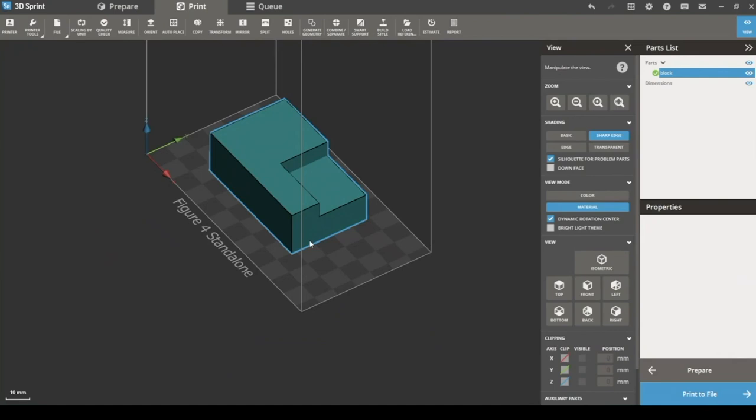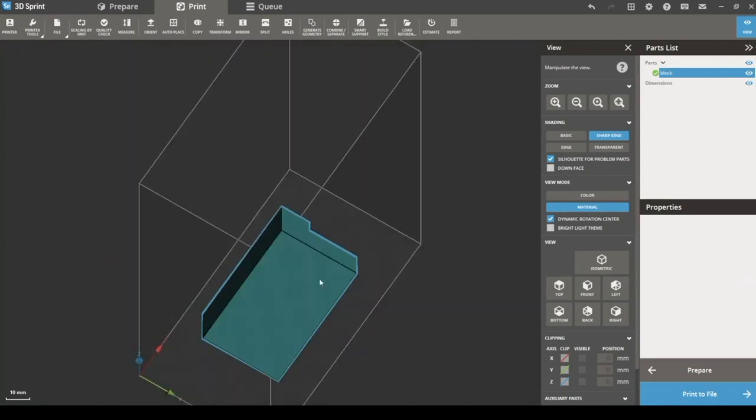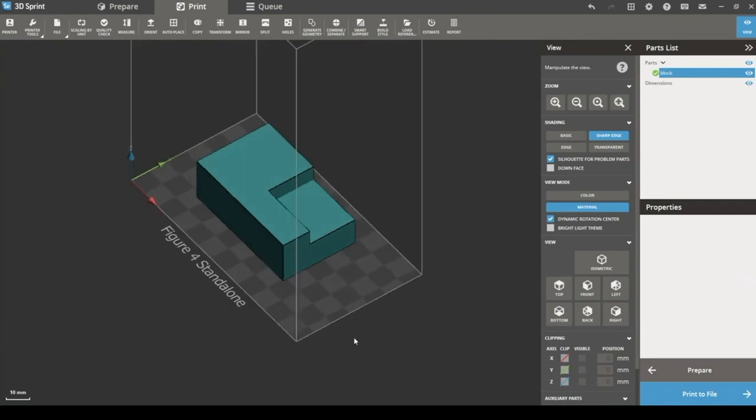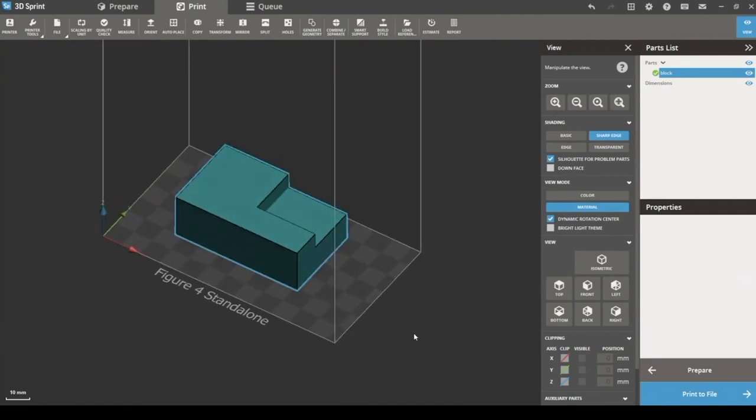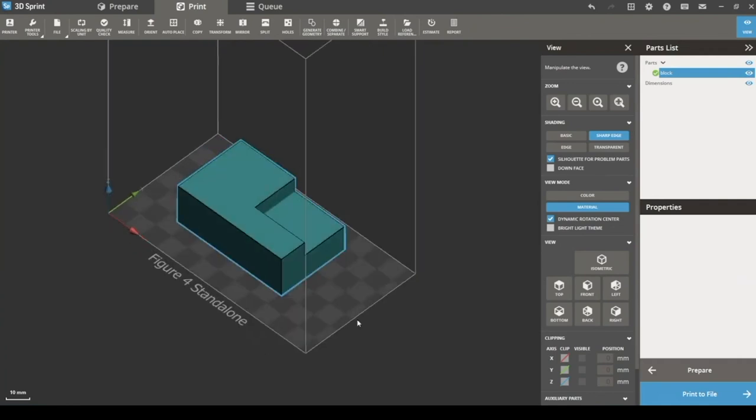So anytime you have big, thick cross sections, you need to think about that and say to yourself, could I injection mold this part? If I cannot, what am I going to have to do? One of the big rules of thumb for injection mold is go to uniform wall thickness. So what can I core out and support and rehatch inside my part that I still get the intent and the application? I still get the features that I want. I still get the visual effects that I want. But I can make this technology work for me to where I can print this part and be successful.